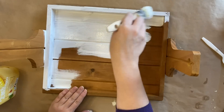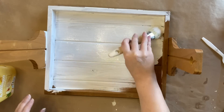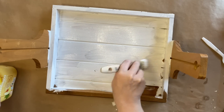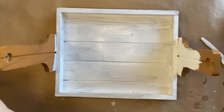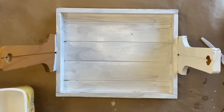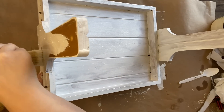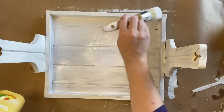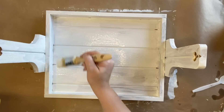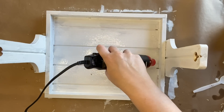I'm going to work my way around this little caddy and coat the entire thing. I know I've been using milk paint a lot in my videos — it's just such a fun and unique paint to use. It can be unpredictable, but I feel like I'm getting a little bit better at predicting how it's going to respond to different surfaces. If you want a look that is not chipped, you can use it on a raw wood surface and you will not get any chipping. A surface like this that's already sealed will definitely achieve some chipping. I came back in with a little bit more paint as the first coat was a little bit thinner than I wanted, so I'm adding a thicker coat. I'm then coming in with my heat gun to speed up the drying process and get some of that cracking that we love.